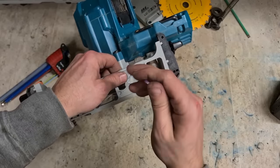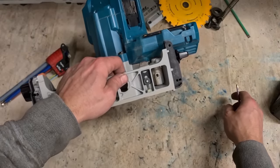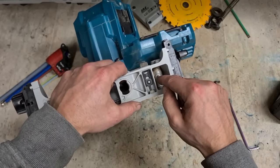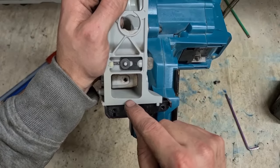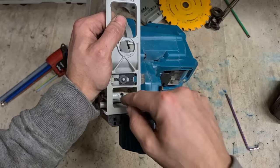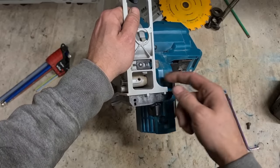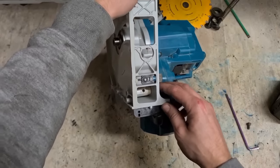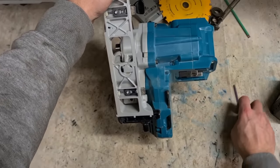Another thing you can sometimes do, does work the odd time. You don't want to go to the risk of stripping this down. Take that socket head out and get some grease and put it down into that hole. Get as much down as you can and put the screw back in again. Put it down all the way tight, take it out again, put a bit more in and use it like a grease nipple. See if you can get the grease to actually push through, expel the dirt either side and actually free it up. Sometimes it works, sometimes it doesn't. But if it saves you stripping the whole thing down, it's worth a try. This time we're just going to see if we can get it out.